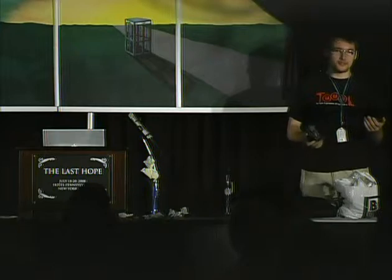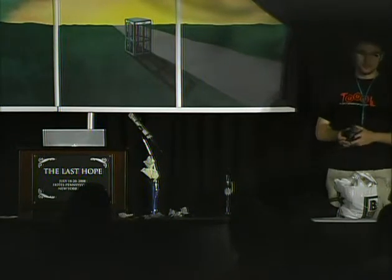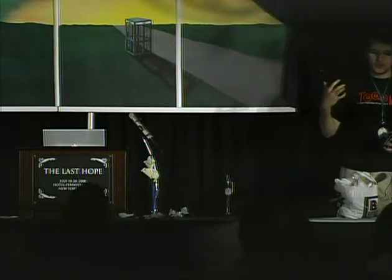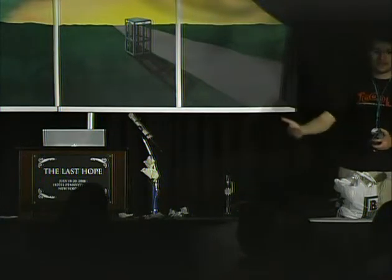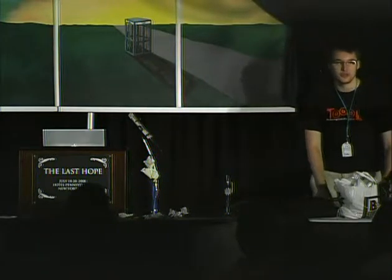First time you open the safe, it'll take you quite a while. It took me, I think, 6 hours or so. Because you're going back, you're charting, you're trying to figure out where you made the mistake and then made the other mistake. And you're realizing, oh man, I screwed up way back at the beginning, I have to start all over again. But then once you get an intuitive sense of it, then you stop making mistakes. And you start getting it right, and you get your times down to 3 hours, maybe 2 hours, which is about what most safe technicians will take to actually open a lock by manipulation. This is why many of them carry drills.